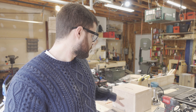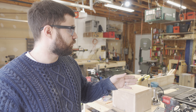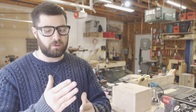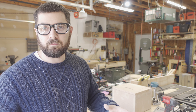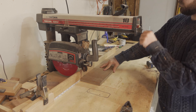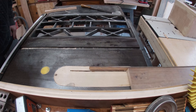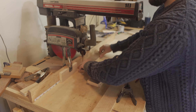I then used my absolute unit of a belt sander to even out and square up the box. While the wood filler I used to fill in some of the plywood voids dries, I'm going to start on the stand. I have some long lengths of three-quarter inch plywood left over that I think are going to make the pedestal — I might just make it an interlocked X and then make a square base for it. To start the base I headed over to the radial arm saw and knocked off the rounded ends of the board, then ripped it down to width on the table saw.